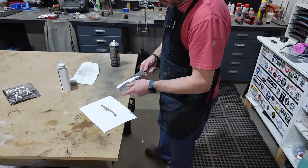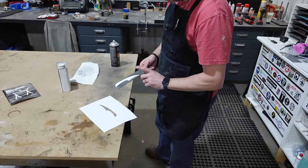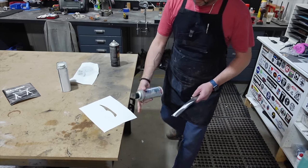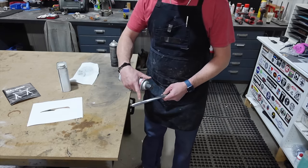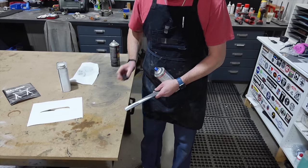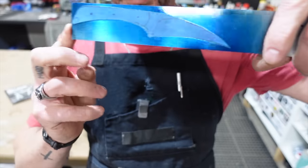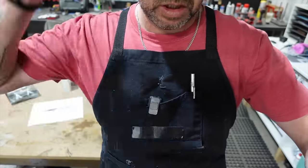What I'm gonna do now is actually spray this with layout dye. I like the spray stuff the best. That way, as I'm grinding or cutting, if this paper template kinda gets burnt or something, I've got a silhouette. There she be. Now let's go cut it out.